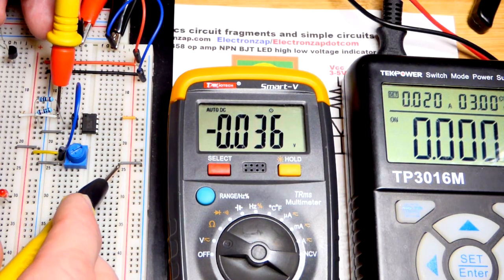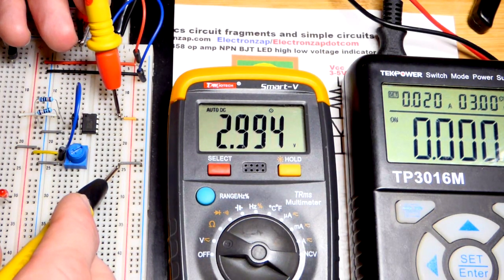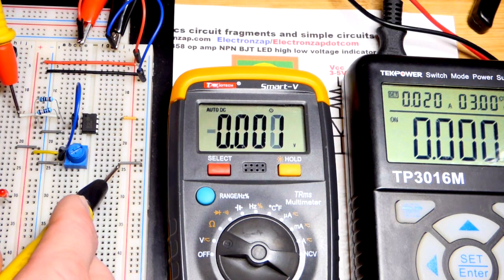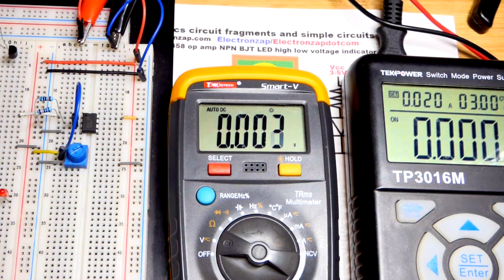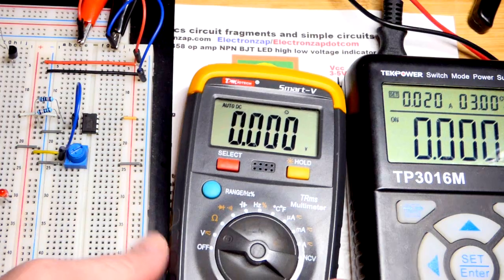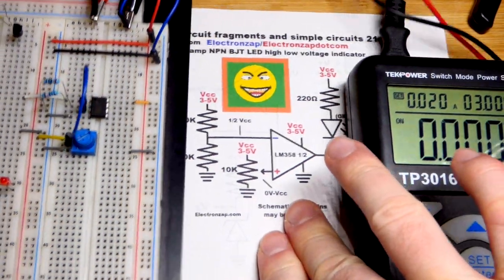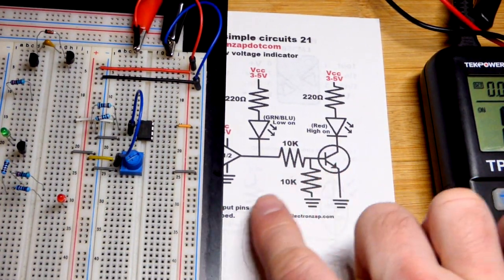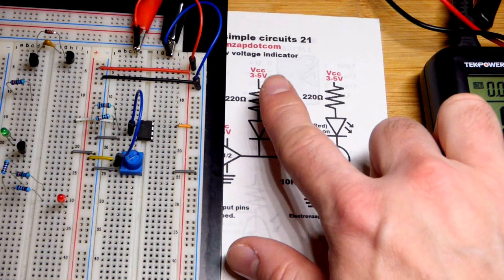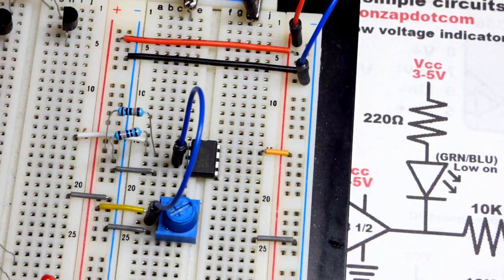The output does go to the negative rail — it may even be a spec below for some reason. You can see three volts at the power rail and zero volts at the output — just like a direct connection to the same spot. We're limited in how much power it can output, which is why for our load we're going to include a transistor for when we have a high output.